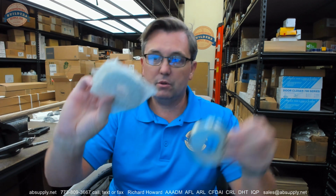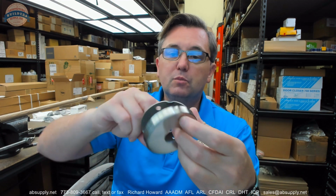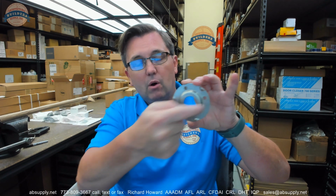But what makes this UX1 different from other UX1s, again, is the J. And you're going to get a couple of flanges. They're identical. These stainless plates are going to get mounted to the wall. So what I would do is I would locate my plate, mark the holes, prep the wall to whatever needed to happen in terms of an anchor. I would slide my 2 plates over the rod.